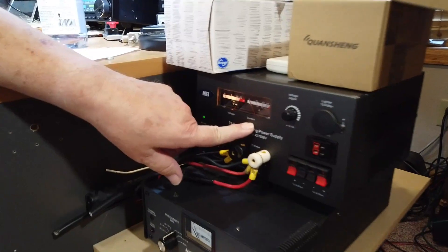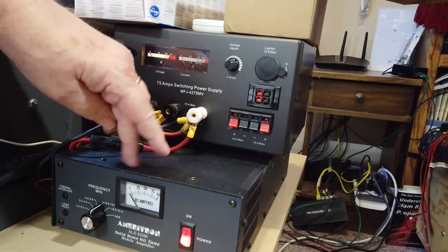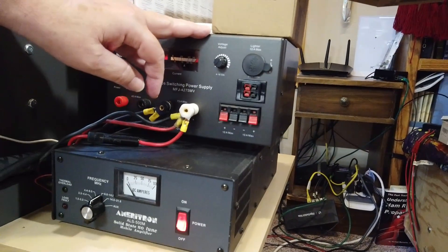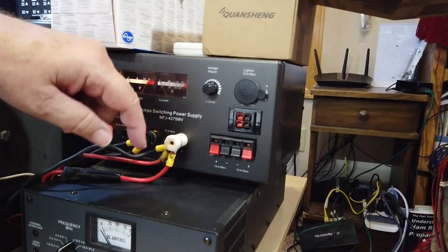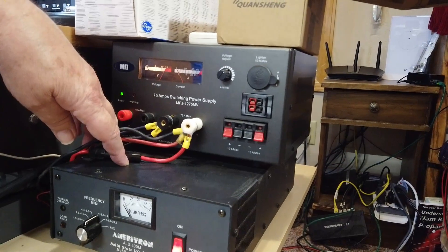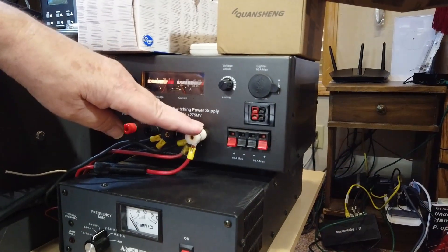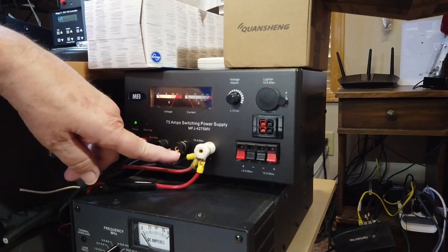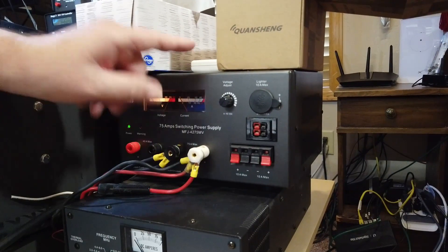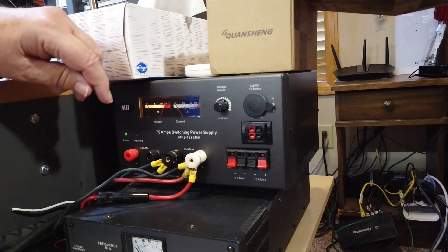Note that this is a 500-watt amplifier, so it's going to draw closer to 1,000 watts from the wall because it is a linear amplifier. That works out to about eight or nine amps out of the wall outlet. It would be nice to put this on its own dedicated wall outlet — that's not always possible, but it's a big hunk of power going into this thing. Nothing to play with — don't use undersized cables.